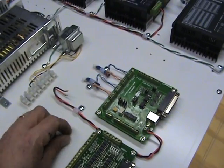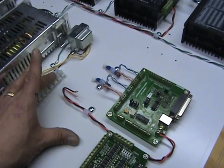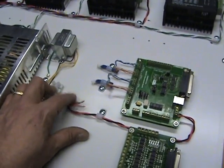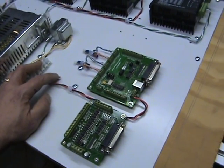In order to operate the relay, I needed a 12 volt power supply. I got a 12 volt transformer — didn't read the box. It's a 12 volt AC output, so I'm going to have to get a couple of diodes so I can convert that to DC.